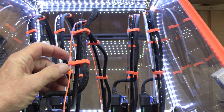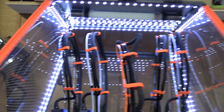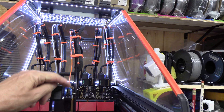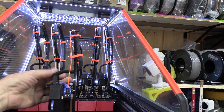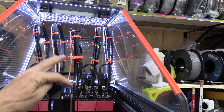That didn't help, ironically. I bought the Capricorn Bowden tubing — the Gore-Tex tubing made by Capricorn, supposed to be the very best — still didn't help. The next thing I tried was to minimize the amount of tubing, using little segments with tape to hold them in position. But that's not a good idea, because without full-length tubing, it will shorten up this cable and distort it. You need full-length tubing to maintain the arc. So you've got to have continuous tubing in here.